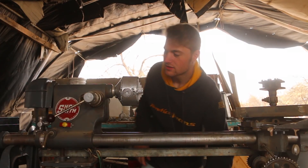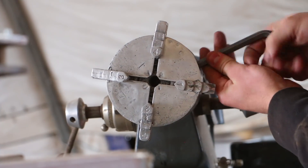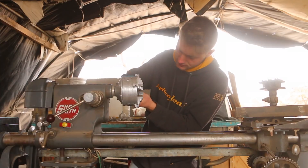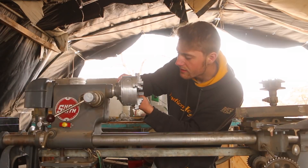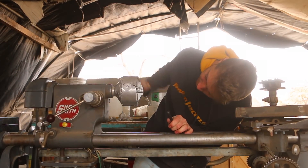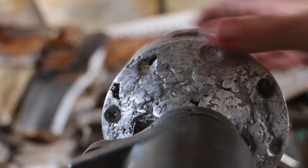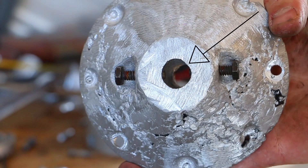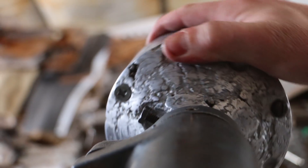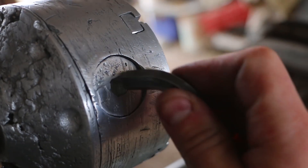It's looking good. Everything's looking beautiful. Let's go ahead and give it a rotation. Look at that. There's a little bit of — it kind of jams every now and then. Otherwise than that, there is a serious wobble to it. I can see it from here, but that's mostly because this back here — I didn't drill it out, I casted it — plus it didn't really turn out too well. So I would want to recast that and that will definitely straighten it out. But otherwise than that, it all works.